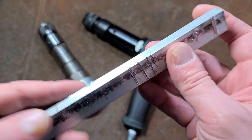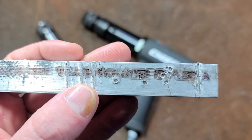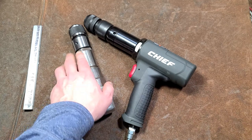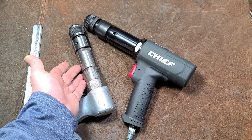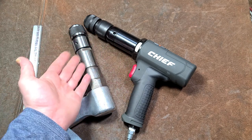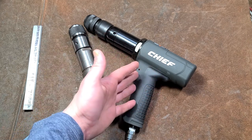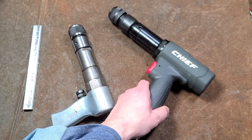So there you have it. I'm sorry for yelling - I had earplugs in so I couldn't quite hear myself. It's hard to judge something like this, because the effectiveness of one of these tools isn't just about how heavy the piston is. It's about how fast it's actually moving and traveling, and how many times it reciprocates per minute. That's the work done - that's how you get a calculation of total energy delivered over a given period of time, which determines the amount of work an air hammer can do.